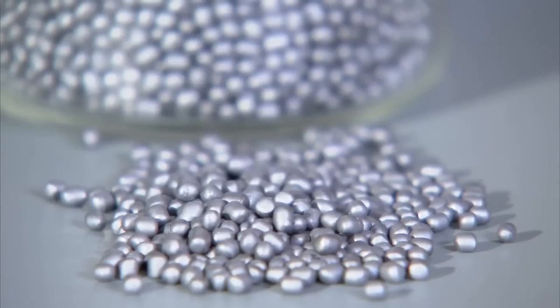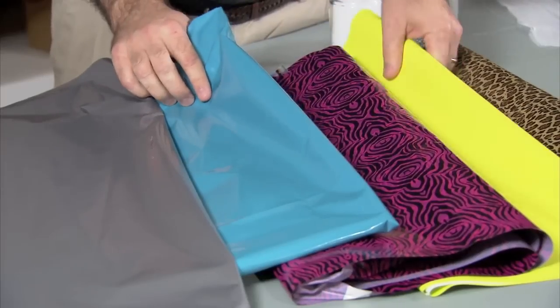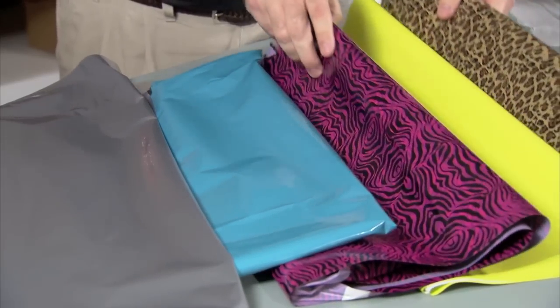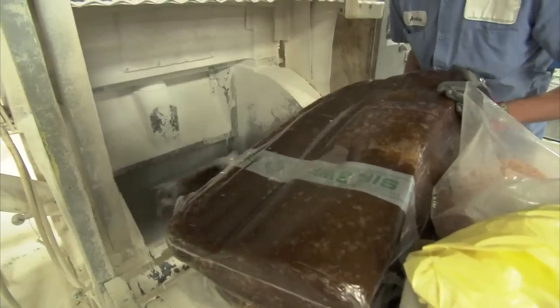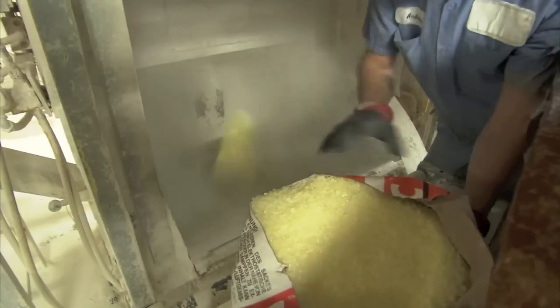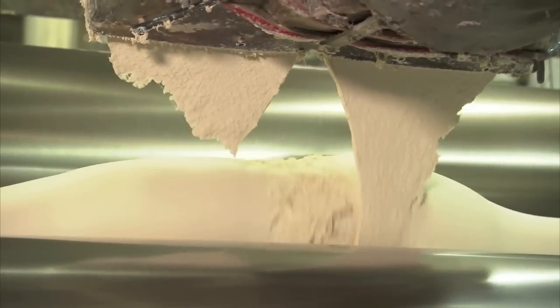You can add various color concentrates that give you your base color — this one would give you your natural silver. But you can add other color concentrates to get blue or yellow, and you can even print the film to get nice patterns. The process begins with making the adhesive in a machine called the Banbury, where they mix the gooey rubber with a sticky resin until it's about the consistency of pizza dough. Then it's fed into the Sigma, where it's heated and mixed some more.